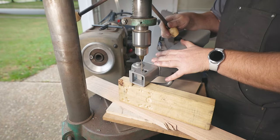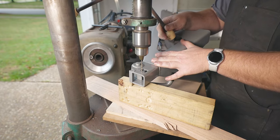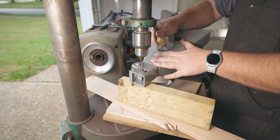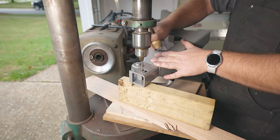To improve the base, I'm first drilling an assortment of holes — one that is aligned to the tang you're supposed to press in, and then another set that goes through both sides. The single hole gets a nut tacked in while using a fastener to align everything, then it gets fully welded in place.